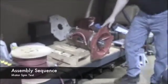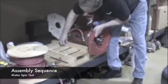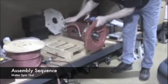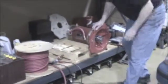We're going to go ahead and test spin this motor. When you test spin a DC motor, I'm going to block this motor up on the armature or on the field bolts so it can't rotate. There's a lot of torque on a DC motor when it spins. Now under 12 volts it's not going to have a tremendous amount, but I still want to make sure it's secure.